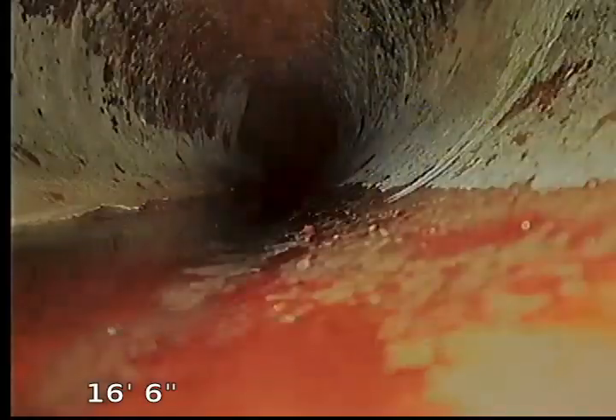We have an immediate 45-degree elbow turn going down, and then you can see it immediately transitions into cast iron. It's a clean transition. So we're going down this vertical pipe here at a 45-degree angle. Cast iron looks in good condition here. Here we have a corrected 45, and we immediately transition into clay pipe. So now we're into 4-inch clay pipe.